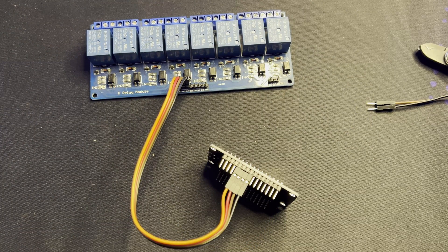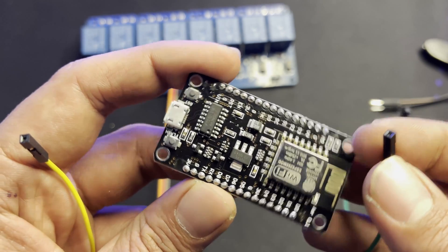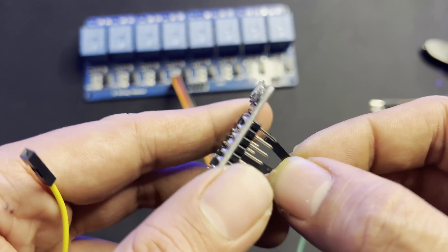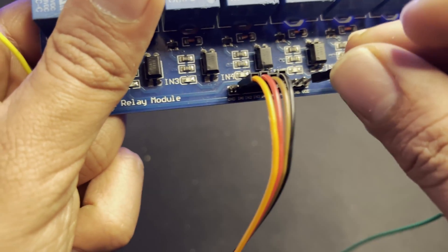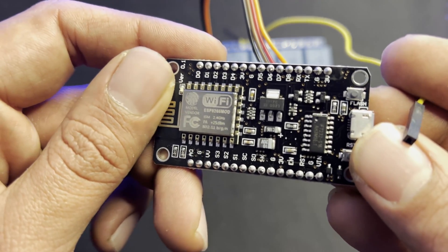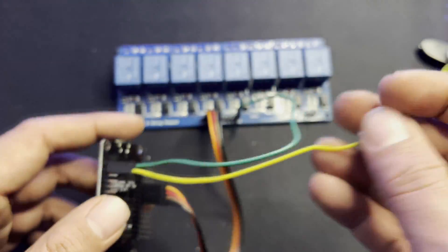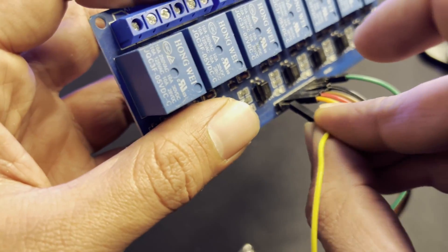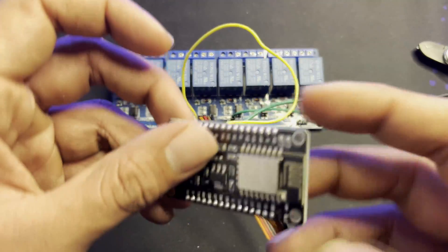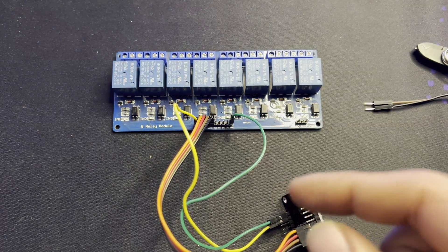Now I will connect 4 wires between the relay and the ESP8266. 5 volts will go into the VIN of the ESP8266. Here is GND and VIN — VCC of the relay. The ground pin will go to the ground pin on the ESP8266. Here is GND, and it will go into the GND of the relay. So ESP8266 and relay have been connected.